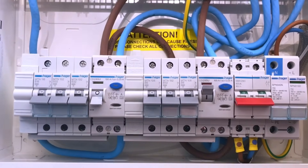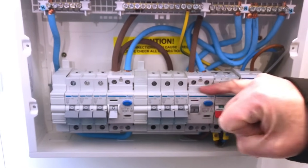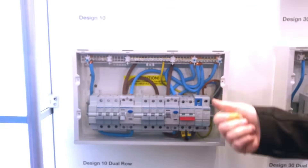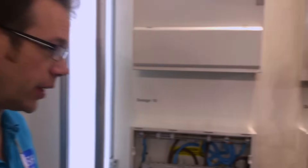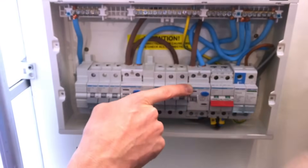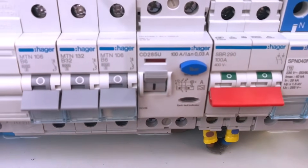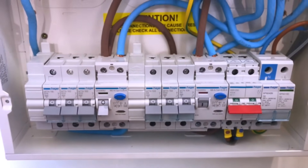There's one further point from the 18th edition: it requires consideration of overload protection for the RCD, which is the only device used today that won't trip on overcurrent going through it. So you either need to ensure the connected loads won't exceed the RCD rating, or — as Hager has done — default to a 100 amp RCD matching the maximum current for the consuming assembly of 100 amps. That way, you can never draw more current through the RCD than can be connected to the board anyway. It's those little details that make all the difference on installation.